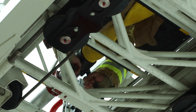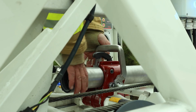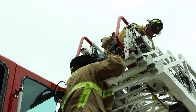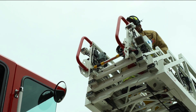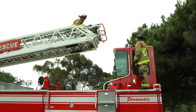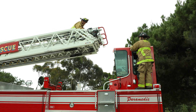The hose shall be disconnected from the ladder pipe and set aside. The nozzle can then be unlocked and removed. It is recommended that a crew member standing on the trailer assist the firefighter on the ladder with the removal of the nozzle by preventing it from tipping forward when the clamp is unlocked. The nozzle should no longer be projecting beyond the tip of the ladder. The ladder operator can now resume lowering the aerial ladder with the crew member riding inside the fly section of the ladder.